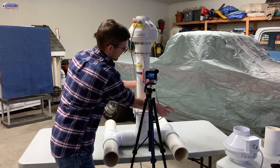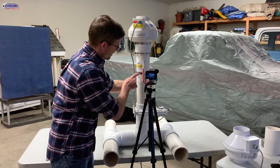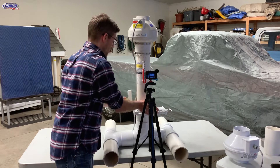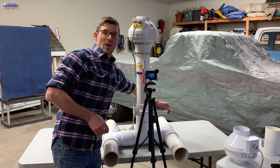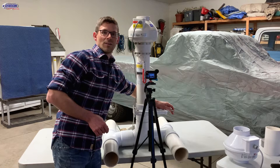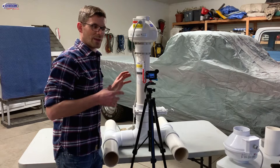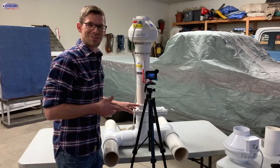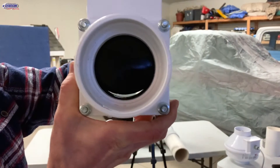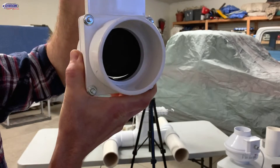So here we've got that dialed down. I'll close it all the way and the water just stays about the same, creeping up to two inches. The downside to these gate valves is when you have it almost all the way closed you get a whistle — and this valve is in the house, so that would drive me crazy if it was in a bedroom closet or something like that. The valve is open probably about this far right now, and it's fine if it's open like that, but if it's just cracked like that you're not going to want to use a gate valve.